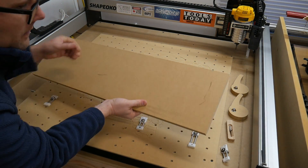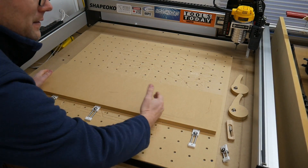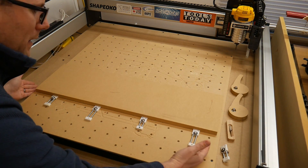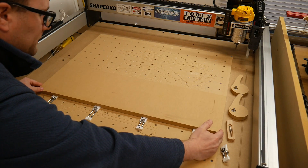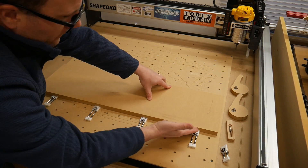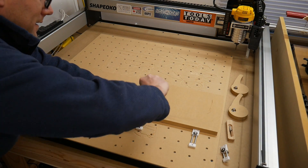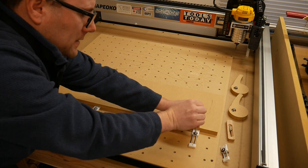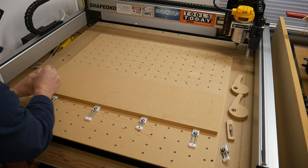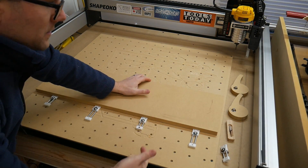Then we're going to take our piece — 31 inches long by 4 inches wide. Mine's a little wider and a little thicker; I just didn't want to cut it down. But it is 31 inches long. So we're going to fit that centered in my wasteboard here. I'll pull it evenly down, and that gives me the straight line against here — so I know that this is straight now. I'm going to go ahead and tighten these down really tight, and that gives me the straight line and the clamping pressure I need.